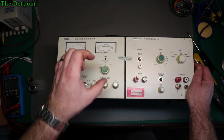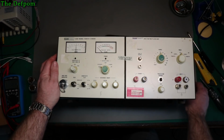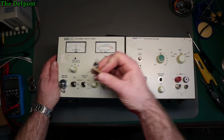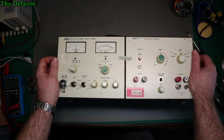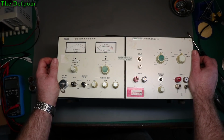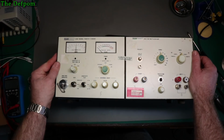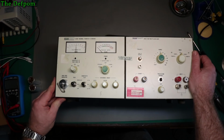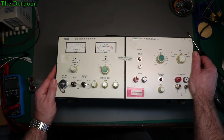That 1.35 volt battery is isolated from anything else, which makes it tricky, because if I want to run a little regulator in there off the battery pack that's in here in order to generate that 1.35 volts, I have to tie those two negative rails together. I'm not sure that's going to have some kind of side effect. I've done a little bit of testing, injecting with my power supply to replace the battery, and it seemed to be okay, but there's no guarantees it's going to be alright.